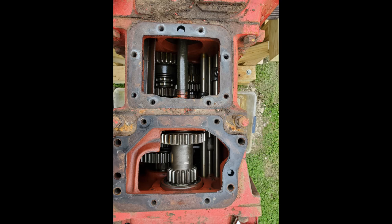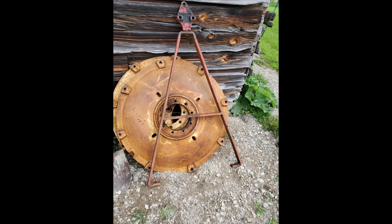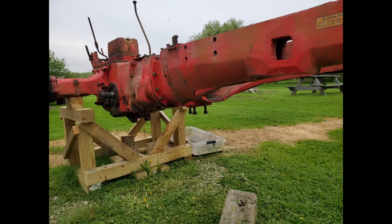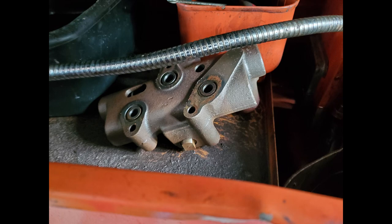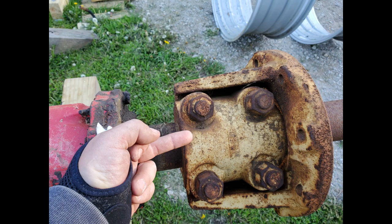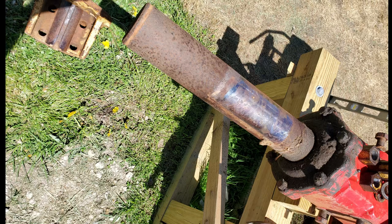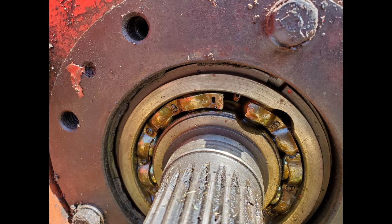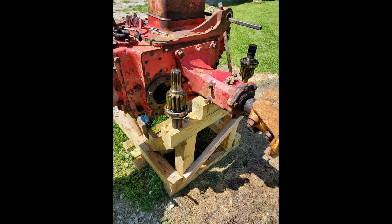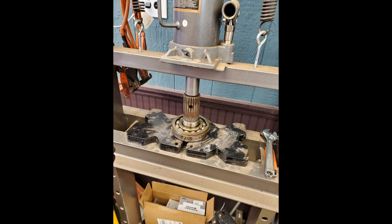Removing the transmission covers exposed a very clean gear set — a great sign. I also removed the front axle, a standard wide made out of a big piece of cast iron, heavy as can be. It pivots on a large set of pins with an A-frame that attaches to the underbelly of the frame. The hydraulic tank came off filled with a skeezy mix of water and oil, so the valve body was removed and went straight into the parts washer. The cast iron hubs came off next, very stubborn but eventually broke free. This allowed access to remove the outer axle flanges, seals, and outboard bearings. The bearing on the right-hand bull pinion shaft had seen better days — the race was broken and pretty crunchy — so the pinions came out to receive new bearings, pressed out and replaced with new monster five-inch units that look like they could have been used on a Sherman tank.